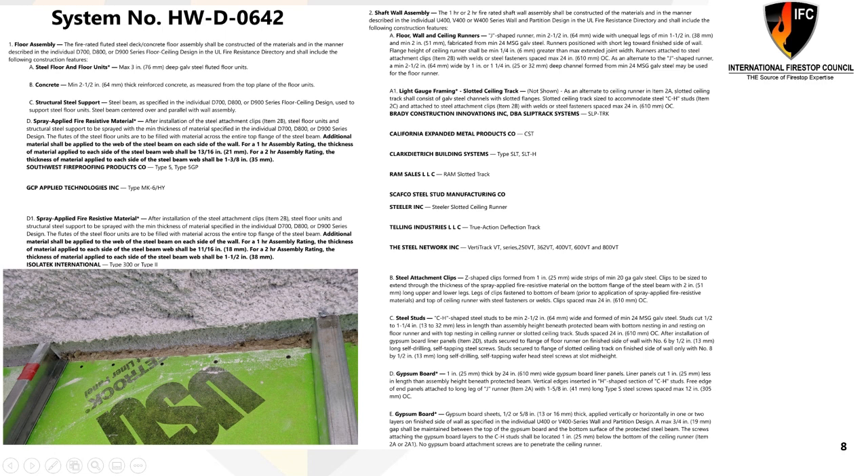Some of these listings are going to be anywhere from one to six pages long. We all want to get our job done quickly and efficiently, but it is fire and life safety, and we have to read through all of the listing. Not one part of the listing is more important than the other — we must match all components of the listing for it to work for our specific area. What we find up top talks about a specific type of floor assembly. Even though we're not the framing or concrete inspector on a project, we still need to verify that the assemblies we are working with are rated and in fact built as required by that specific listing.